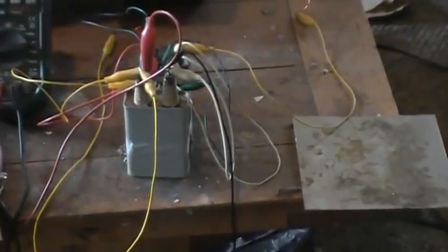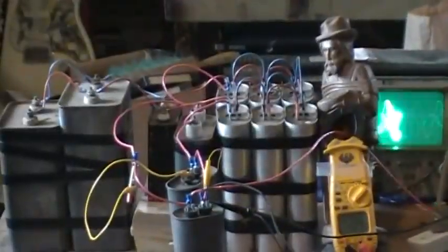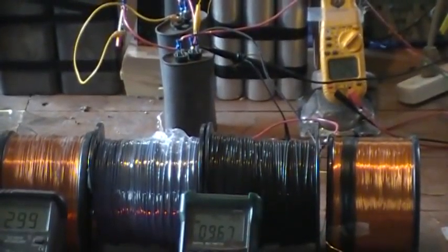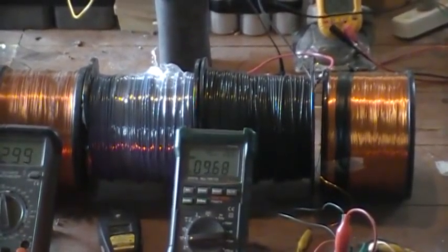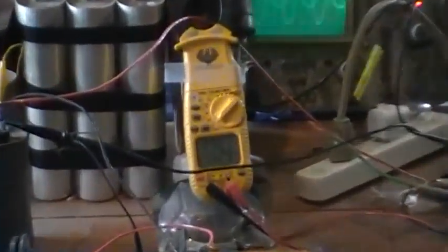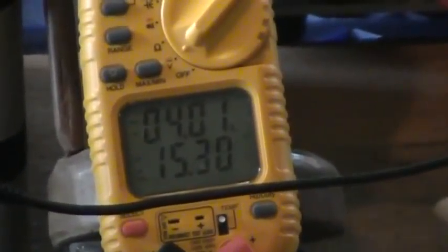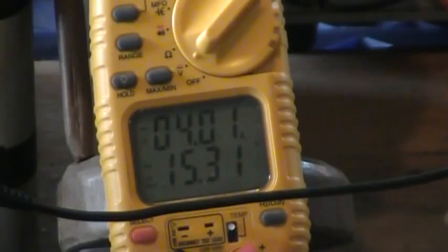Then over here, what we did to power factor correct it is we added another cap to the system so that it would compensate for the loss of inductive reactance brought on by bringing in the secondary loops into those poles' vicinity. So if we went and tested the matching of the reactances, which would be hard to do with the neon because it's got to be lit for it to be tested against, where a night light you can get away with it, but not neon.